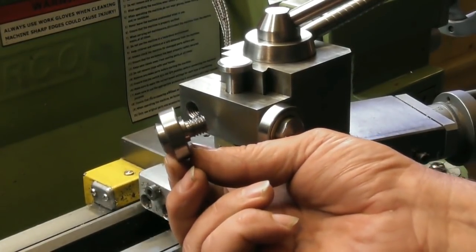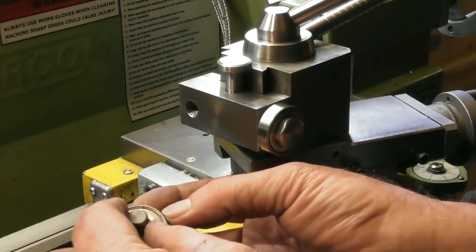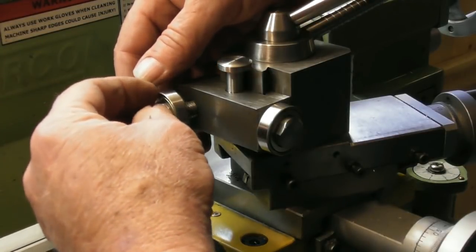I just squeezed the little spindles that I made into the bearings using a vise and a socket — pretty simple job. So that done, fit the little brass spacer to keep the outer track away and fit it to the pusher block.